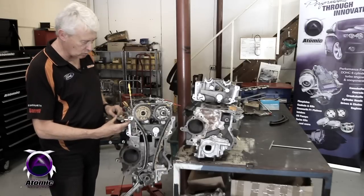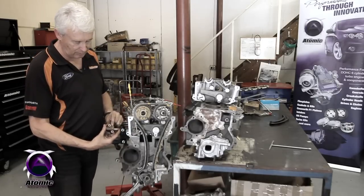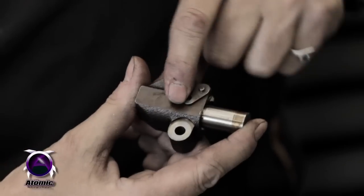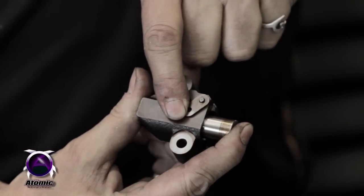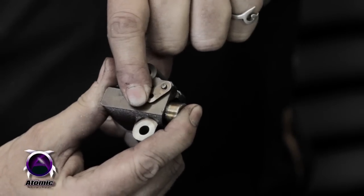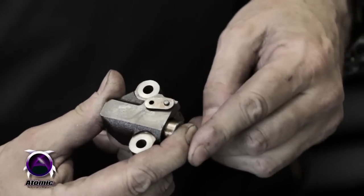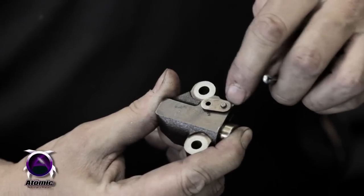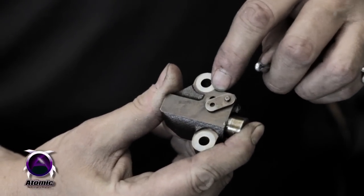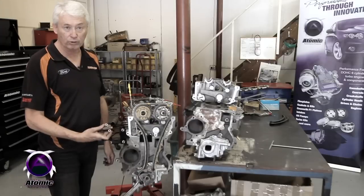When you're reassembling things, what you need to do is push the little arm — the little pivoted moving arm. You need to hold that down, and that allows you to then push the post back in place until the ratchet is back to the final position. When you push it in with your fingers, the little arm there lines up with the hole underneath, so you can put a pin in there and that holds it in the closed position.